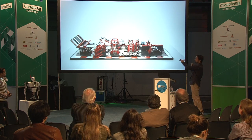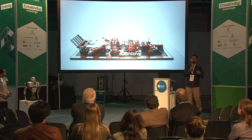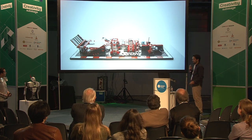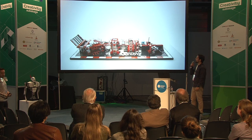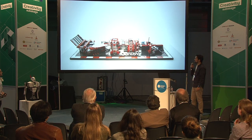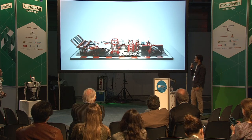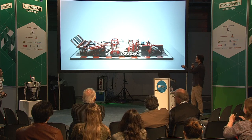I'm going to give you the time so you can see the whole process working. So the first thing is to have the angle folds. That's the most important part. So we have here the first stage with this kind of fold. The second part of the machine will make the wings. Look, the wing is going down. We don't have the middle fold yet. It's going to be made in this part.